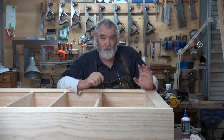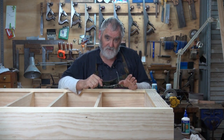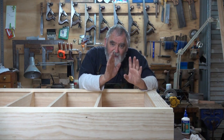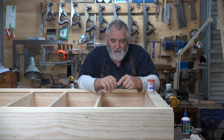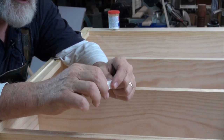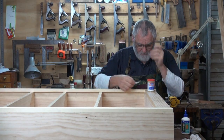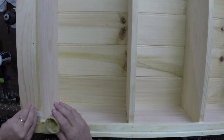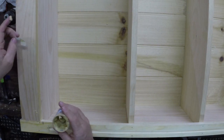Now what I'm going to do is put the skirting or moulding on the bottom. But before I do that, I want to plug these holes up and sand them off because it's going to be a lot easier doing that than trying to fill them once the moulding's on. If you remember last episode, I used masking tape to surround the area I was going to putty. What you do with holes is get a nail or a punch, poke it through and fold the masking tape over where you've poked it through. So you've actually got just a little hole there — it's so easy to putty nail holes. You just put that hole over where you want to putty, pull it off, go to the next one, putty it, pull it off.